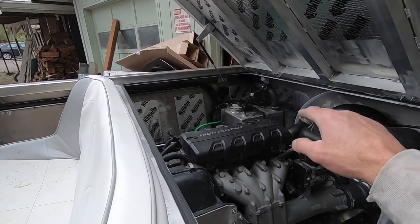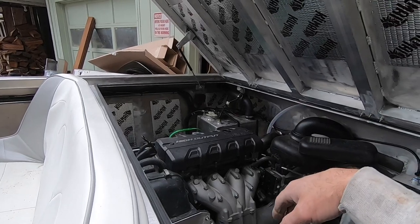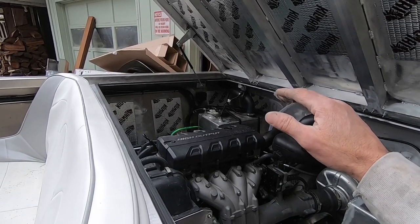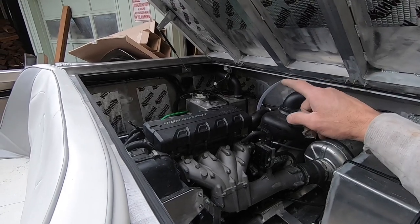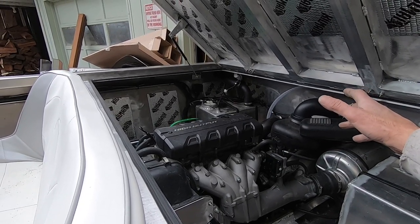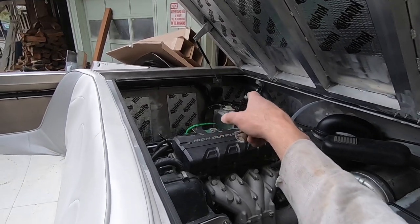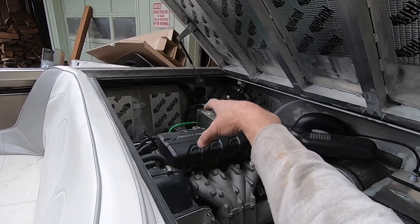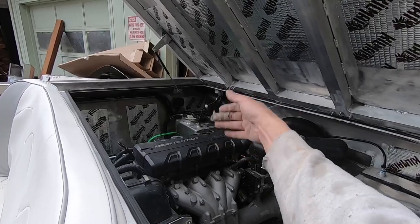So I'm like, I don't know, maybe the way I have it angled in there, I guess theoretically it could be hanging up on the divider in the tank, like bouncing up and then sticking, or I don't know. But it didn't look like anything's crossed over. And those vent lines are before the check valve, so they're vented to each other. You'd think it would even push the air through, but it didn't seem to do that. So I have to work those details out, and I can always loosen that fuel pump ring and spin it a little bit to get it closer to the... because it's tight inside of there. You have to have it angled just right for the float to move freely.